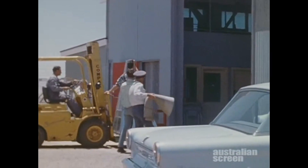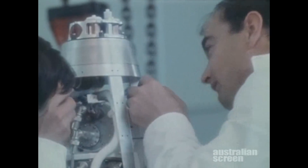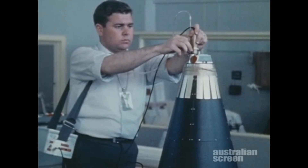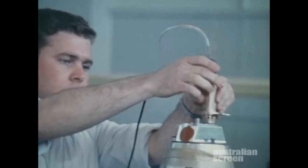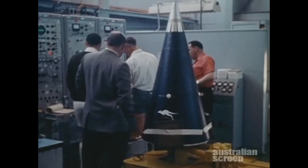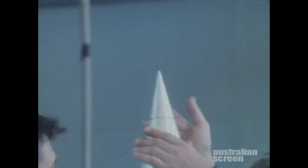With the arrival of the WRESAT cone from Canberra, final checks and assembly were begun. The cone was checked out and explosive components were fitted. The sensors received a final check using a hydrogen light source rich in ultraviolet. The space between was flushed with nitrogen gas to prevent oxygen absorption. The radar transponder received a final check. Finally, the covers were fitted, the nose cone was screwed down, and WRESAT was ready.